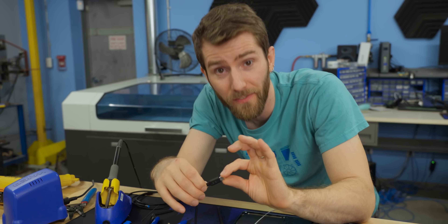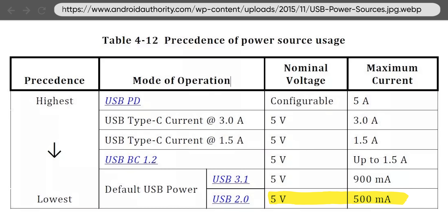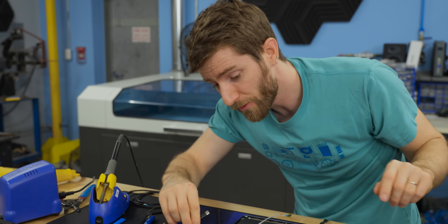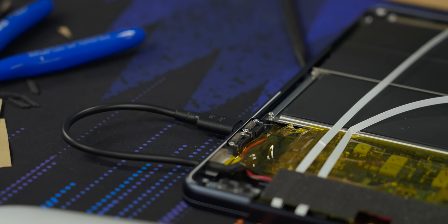While we're waiting for the next step — these are really cool. They're USB PD cables, labeled nine volts, five amps. If you were to plug in a regular cable, it would be limited to five volts and 0.5 amps. For USB PD to activate — the higher amperages, higher voltages — there has to be a handshake. These special cables have the handshake chip inside them, so you just plug them in and they can grab whatever voltage they need. In this case, for the little controller board.